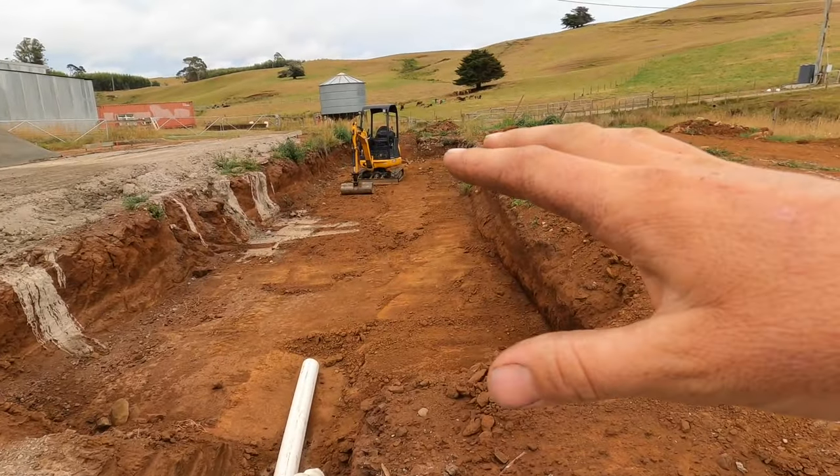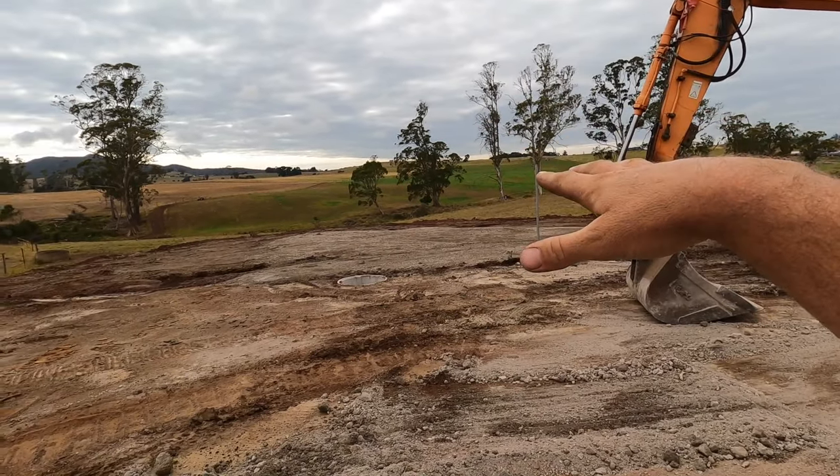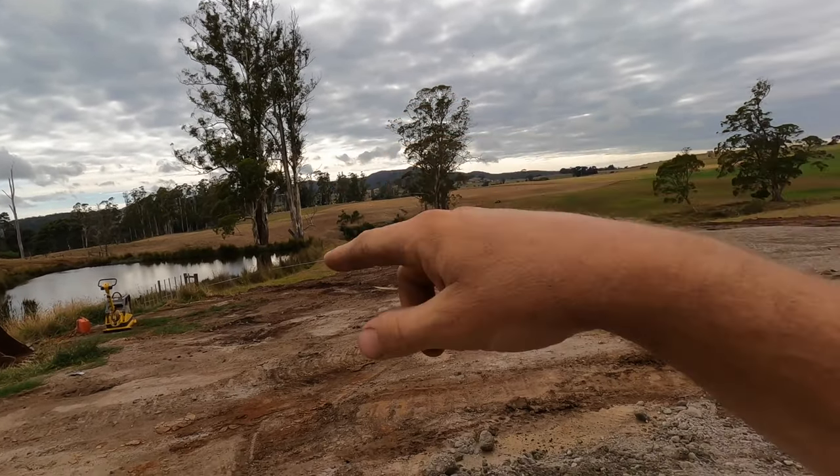Then it's got to go through council. You've got to apply there. It's just the amount of red tape you've got to go through to prove that you're not going to do anything wrong and you're going to do everything by the book — all the engineering standards, surveying, all those sorts of details. In between all that, we did get a geotech out and they did some sampling in the dairy area itself. For the effluent, we were planning on having it in the front paddock, but the soil wasn't suitable. So we're going over there where an old bush was — it's a lot more suitable. It's a loam over a clay, which is better for the effluent dam in that it will seal and won't let the effluent go through the soil profile into creeks and waterways nearby.